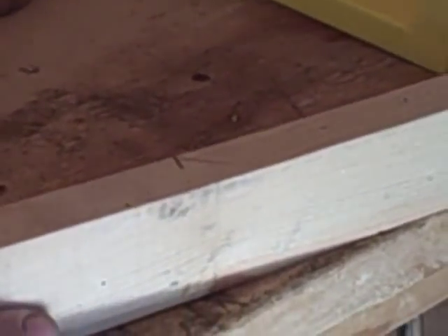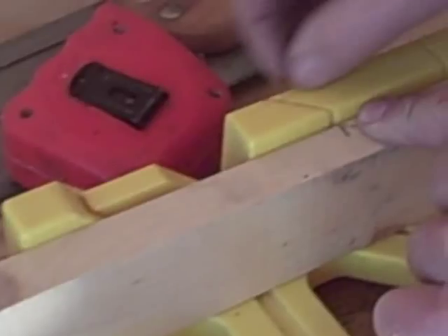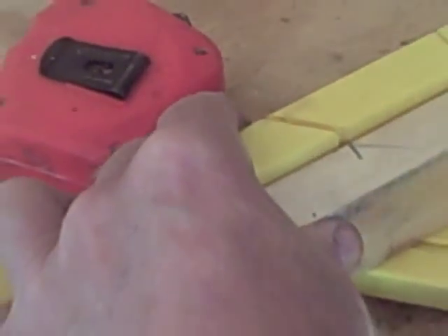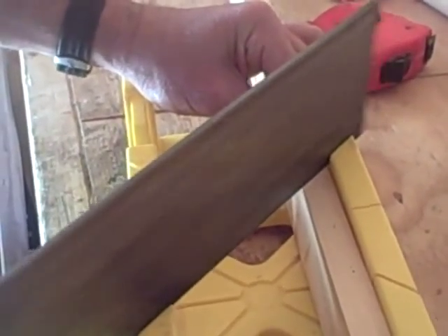This is not going to be my exact 45, but this is going to be my total length. Now when I place this into my miter box, I want to make sure that that line — that total line — is on the inside of the miter cut. I'll show you why. When I place my saw in the miter box, you want to make sure that you account for the depth on the saw itself. Let me make a little mark and show you — you can test it. See, I'm a little bit long there. I want to bring it in a little bit. I always test it — see, that's right on the money now. Then I would just use this miter box as a guide. I'm just using it to show you, but now I know I've got my total 9-inch length.